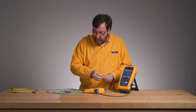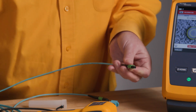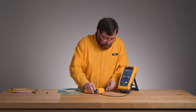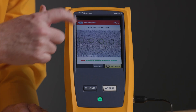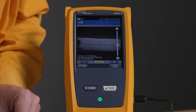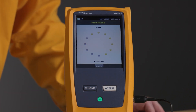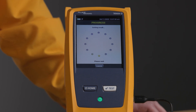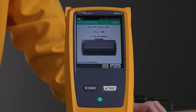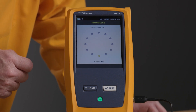I'm going to try testing the other end of this cable and see if we can get one to pass. We'll take it off — and again, the 16-fiber cable has this offset key. We'll plug that into our coupler with the offset key, like so. We'll push Test and get our live image. Tap Analyze. It takes a few seconds — we're looking at 16 fibers, checking the core and cladding of each to make sure contaminants don't exceed the requirements of the standard. This end is beautiful — we're passing. We have 16 passing fibers, no failures.